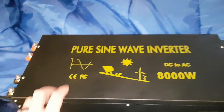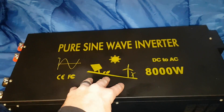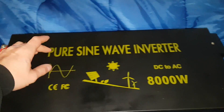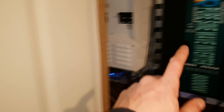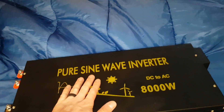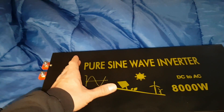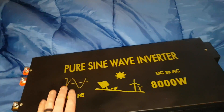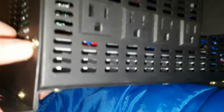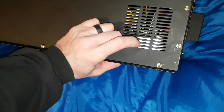I'm going to show you the new inverter. Here's the new 8,000 watt — I opened it up for a quick second. It has four larger transformers, about twice the size of the ones in the old unit. The old one has nine smaller transformers; this new one has four larger, double-sized transformers. The MOSFETs I couldn't see much of — I can just tell by looking that they look similar to the old ones, but everything is under a massive heat sink.